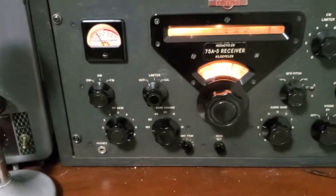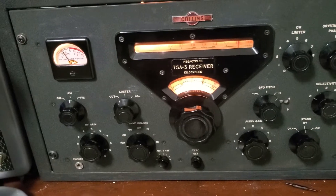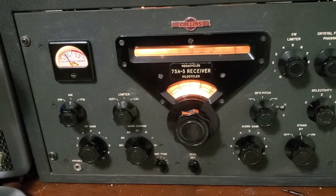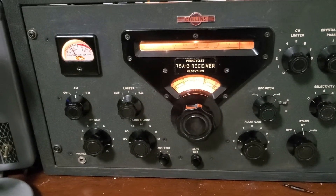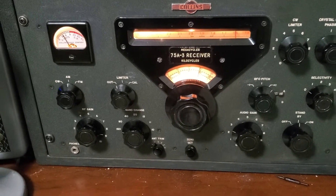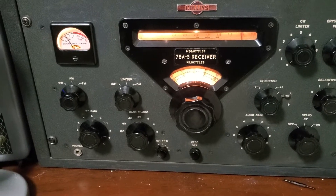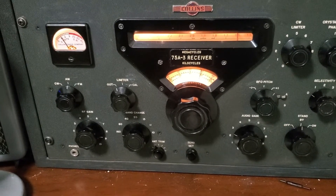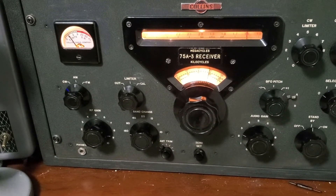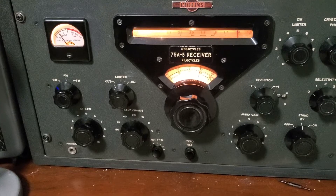That's one way of using something from eBay or similar — grab yourself a filter and find out the true information on it. This 6KC filter is great for AM. If you go to a 9KC filter, it's going to be much higher pitch and much noisier. So this is working pretty good. Now I can do AM with the guys and understand them a lot clearer without muddy bass. This is Francesca — a short video on how to modify the Collins filter for the 75A3. Thank you for watching.